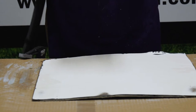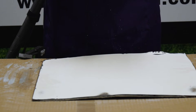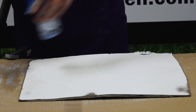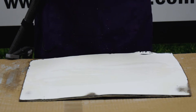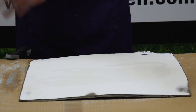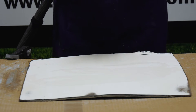My first step in this operation is to change the 400 grit scratch to a P1200, so I'm using P1200 3M purple finishing film. I'm going to sand these all wet — just damp — so that we reduce the loading. These are very fine grits and they would tend to pill, load, and leave horrible marks, so we sand a little bit damp, not wet.